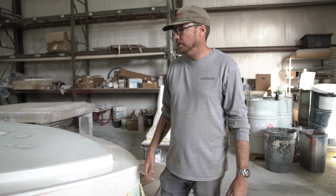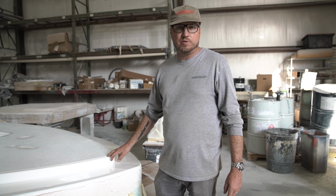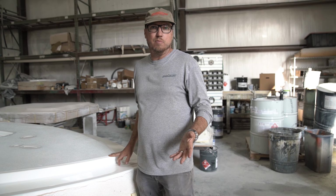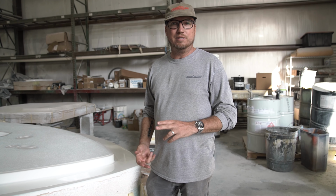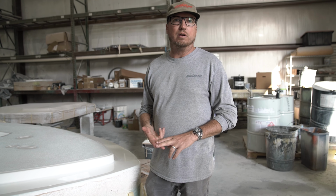You have more buoyancy. This won't be a 100% carbon fiber skiff, probably about 98% carbon fiber. There will be some Airex in the bottom of the hull also. We're looking at epoxy resin, vacuum infusion. So really high tech, you know, really looking forward to it. We have a hull mold done, which we'll show y'all over there. We're getting the stringer mold done right now, so we'll show you that phase.